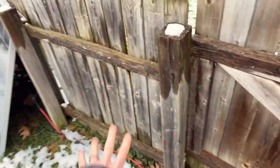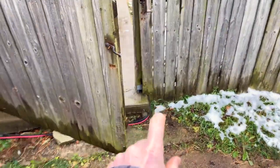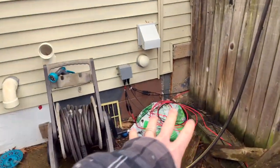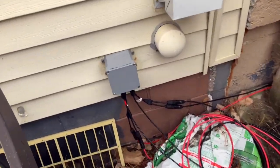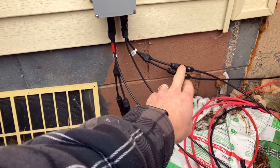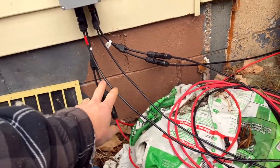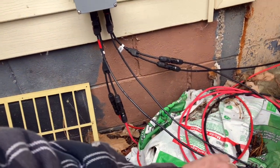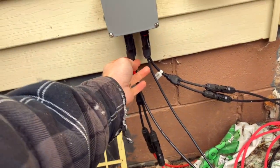I've got my lines right here on the ground — I'm going to end up putting them in conduit. They're running along the ground right in front of the slab and then running back into the area behind my air conditioner. I've got the two sets of 600-watt panels paralleling into the back set, and then I ended up splitting one of my long arrays along the fence line into two separate arrays, so here's that second string.